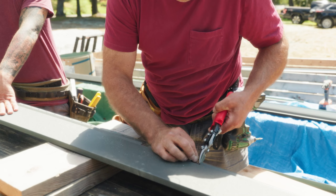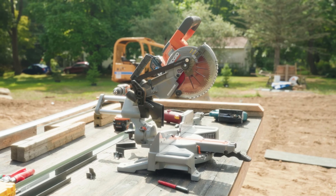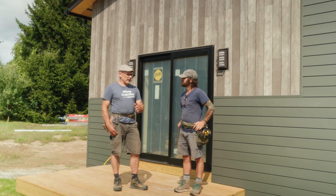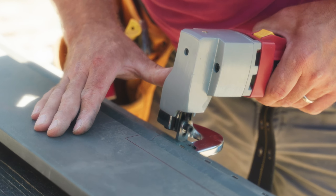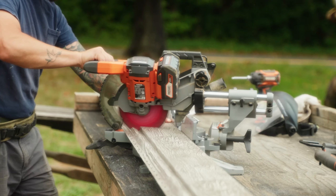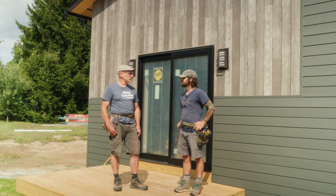When you get the materials, the installation instructions recommend using a chop saw with a metal blade, a circular saw, a jigsaw, and of course nippers. When getting into a steeper angle, we originally started with a jigsaw or the nippers, both of which were a little bit too rough. So eventually we ended up switching to the circular saw, which we pretty much used along with the chop saw for all of our cutting going forward once we settled into that groove.